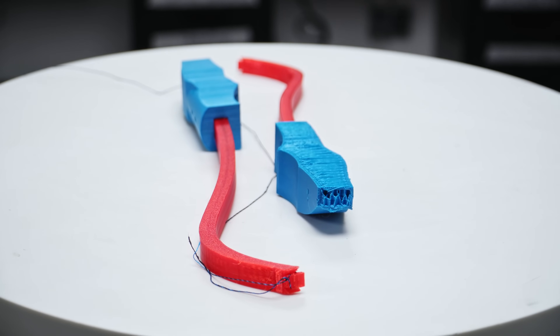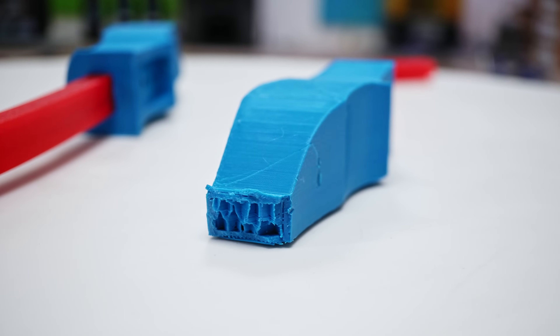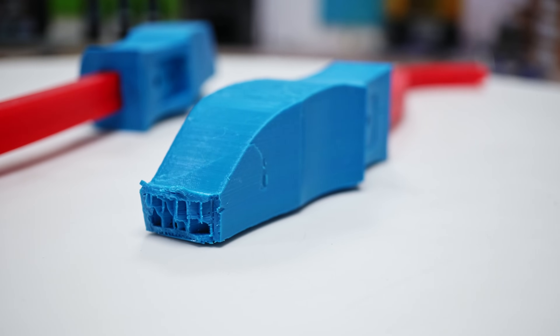The riser was 30% infill PETG, same as before, so next time I need to print it out of a stronger material — I'll use PCTG for the riser. For the limbs I'm switching to PETG carbon fiber from FormFutura. Carbon fill is a very tough, very rigid filament that I use often when I need something strong. I don't usually go for nylon — it's a bit overkill and expensive — but carbon fill is perfect. For the riser this time we're switching to PCTG.